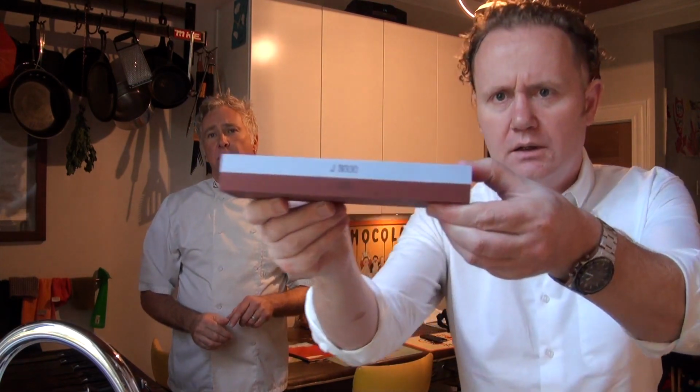Right. The next thing is, and this is the easiest part, is it sharp? Is it pointy? Okay, so you use a thing like this. This has two sides. There's a number on the side of it that gives you a grit. There's one that says 1,000. There's one that says 3,000. The higher number basically means that in whatever area they're counting, there's 3,000 little raised bits as opposed to 1,000. That makes that the coarse side, and that's the fine side.